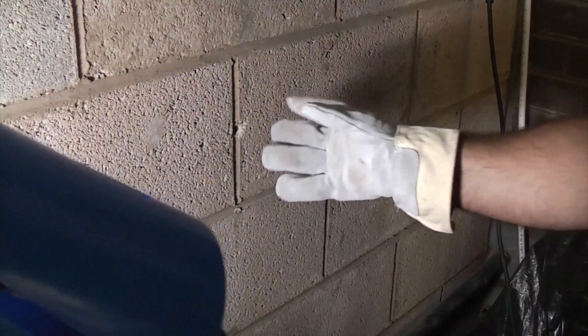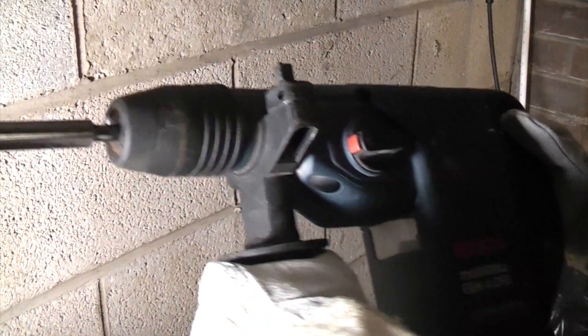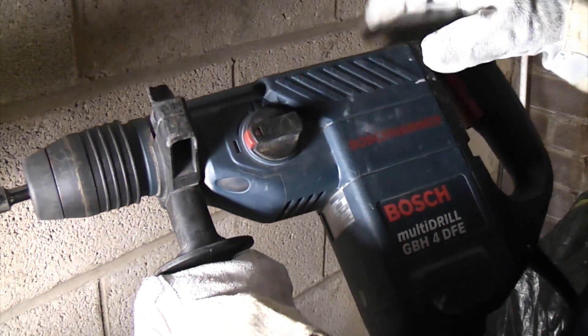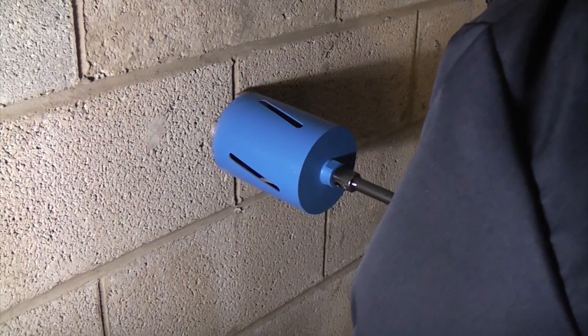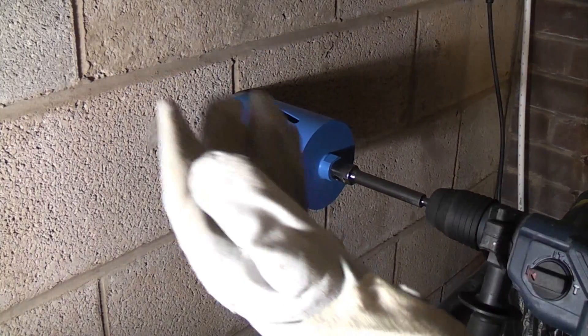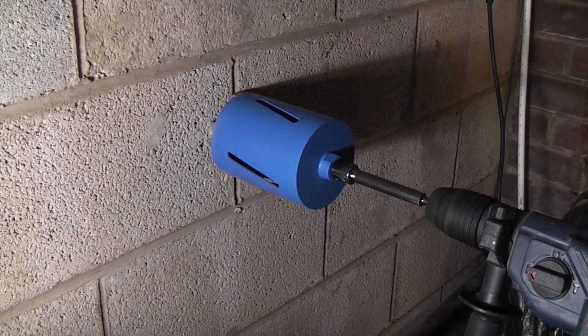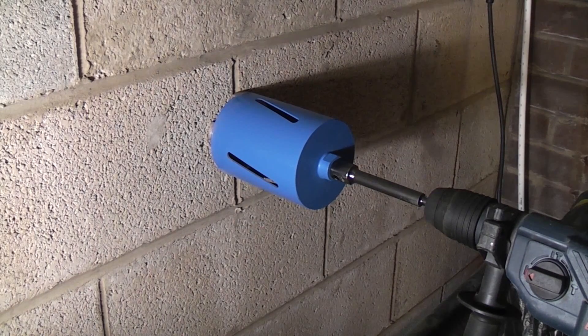The reason I'm doing it this way is so that all the dust is in the garage rather than in the house — it just makes cleaning up a lot easier. Also when you're using a core drill you have to make sure that the hammer action is switched off. All we need to do now is put the drill in the hole we made earlier. I'm wearing safety gloves and glasses, and at this point you don't need to press on too hard — we're just trying to get it started.